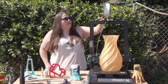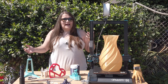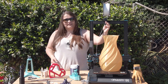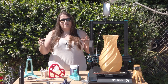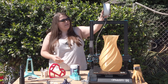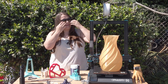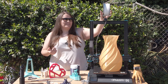Up top there's a filament holder — two pieces you screw into the back — and it has a filament runout detector. I've tried printing without it and the printer constantly beeps and won't let me continue, which is one of the negatives. Also, the two halves holding the filament work for one spool size, but since I have many different spool sizes I'm probably going to 3D print something to make swapping easier.